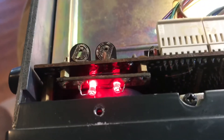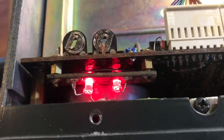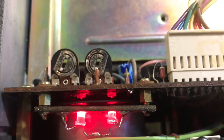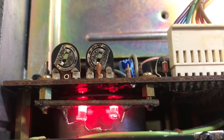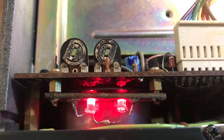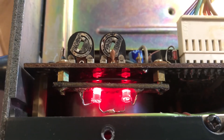I've re-soldered the LED. They're still a little crooked but I can't really go in much more. One of them is almost touching the disk and the other one is a little bit out, but the tuning is working. You can see how it flashes — it flashes one of those first and then the other one next, and that's how it knows which way you're turning the dial. And it's working now.